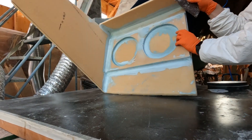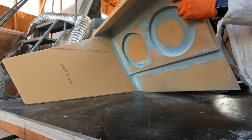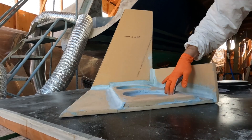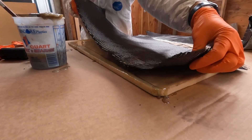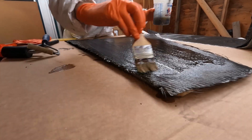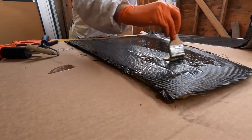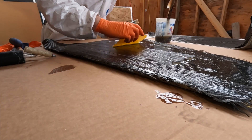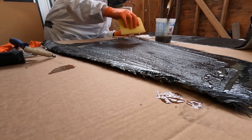The next step was to get it sanded down and get ready to put some carbon fiber on it. At this point I hadn't thought about drainage, and I later went back and added it, because there is a hole for propane — which is heavier than air — to escape out the back. I did a solid fiberglass plug and I'm going to drill a hole through that in the right spot, so water can escape too if it gets up through that hole in heavy seas.